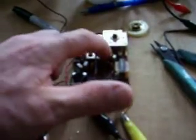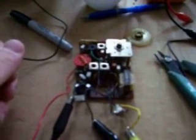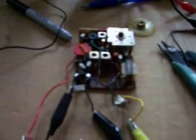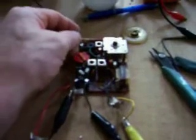And then our 30 microfarad 10 volt capacitor right here, this orange one, was 67 microfarads instead of 30, and that's just a little too much. It's probably 20% tolerance, but that's still more than what I wanted to see in here. So while I had it open, I just recapped all 5 capacitors, and it should be good to go for another 40 years. But let's crank this thing up and see what it sounds like.